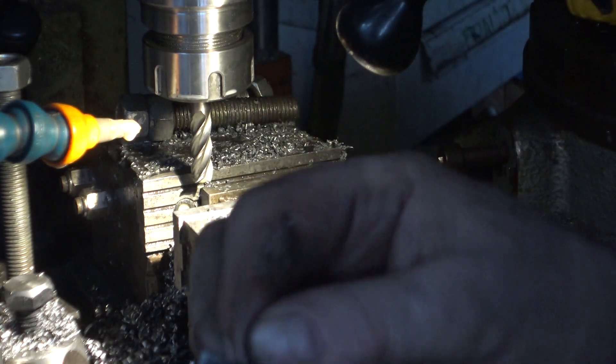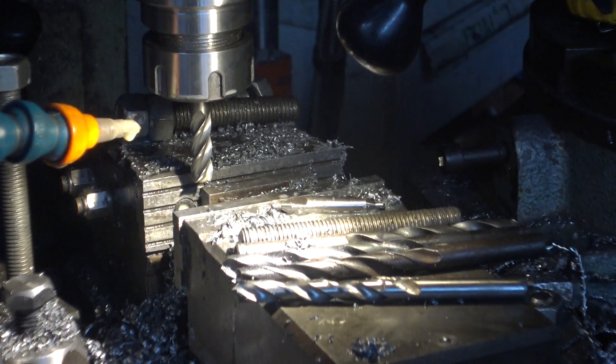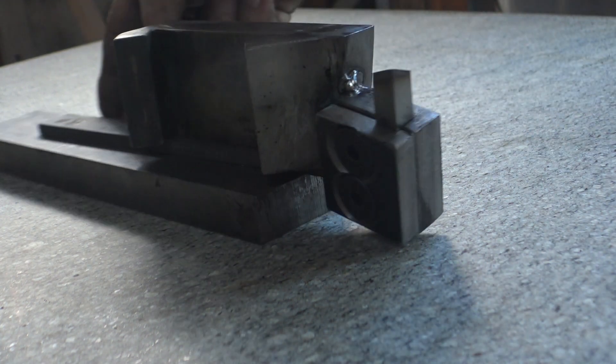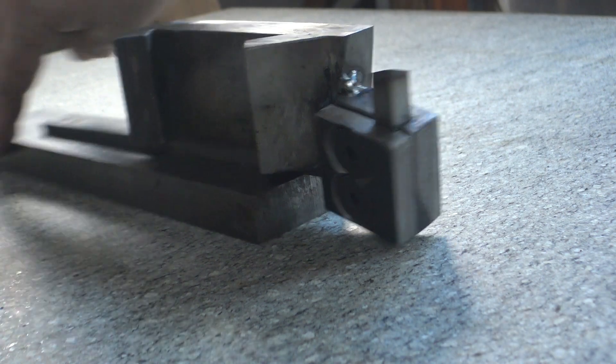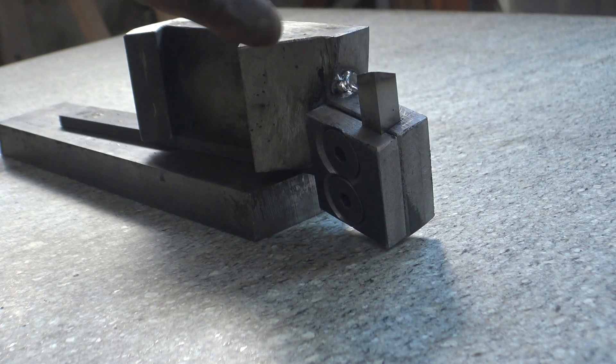Altogether, these two bits now just need deburring, putting together, and then we'll do the final welding to get these two in place. I have been able to place the tool holding block onto the tool holder itself. It's tacked here and here. I will now have to weld this up here, take this apart and make a groove so that I can weld this side onto there.